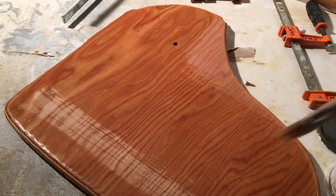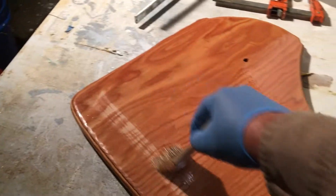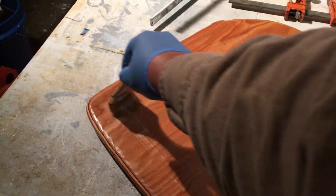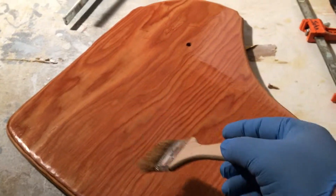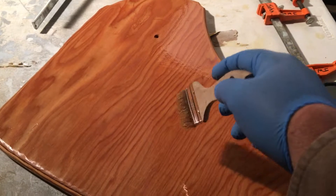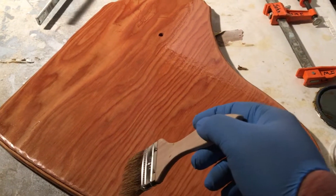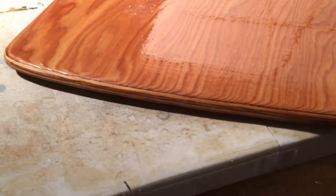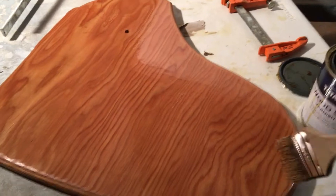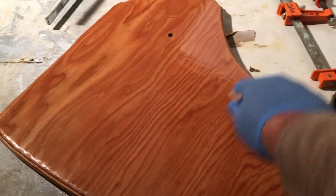The difference with marine grade plywood versus basic plywood: the marine grade usually will have more layers and fewer voids — fewer repairs. Sometimes you'll see something that looks like a football cut out of it. If you get an A grade, that means you should get a side with basically no voids that have been repaired, and maybe a B graded side on the other that might have one or two. It'll have more plies and it'll be glued together with waterproof glue.